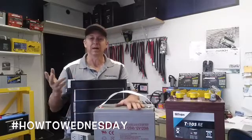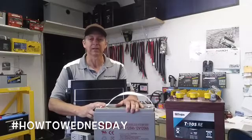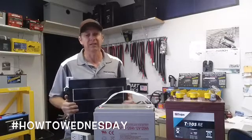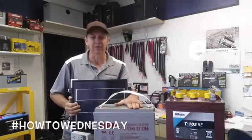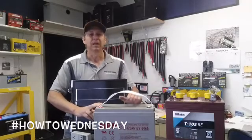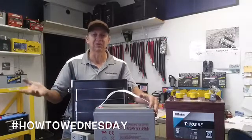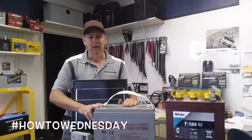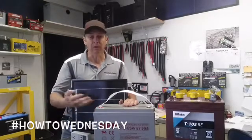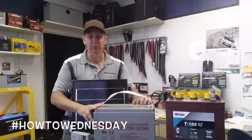Now let's talk about clouds and rainy days. Right now it's raining like crazy — one of the few days we don't get sunlight here in San Diego. You need to size your battery based on days of autonomy. In a situation like today with no sunlight to recharge, we've only doubled our capacity, so we're counting on having sunlight the next day. If you need to safeguard against multiple days with no sunlight, take your amp hours of 54.16 and instead of multiplying by 2, multiply by maybe 4 or 5 — those are your days of autonomy — so you can use your battery bank without worrying about replacing the charge.